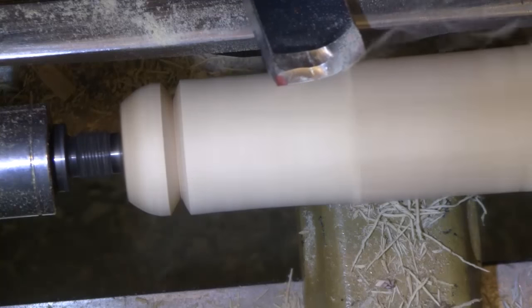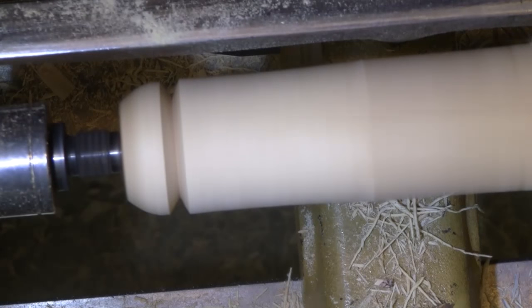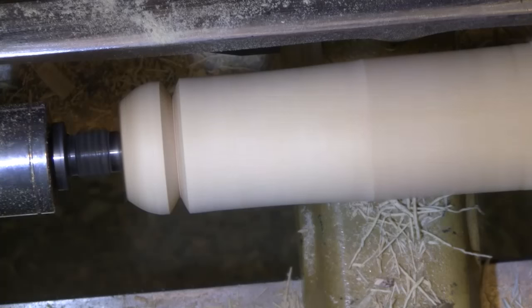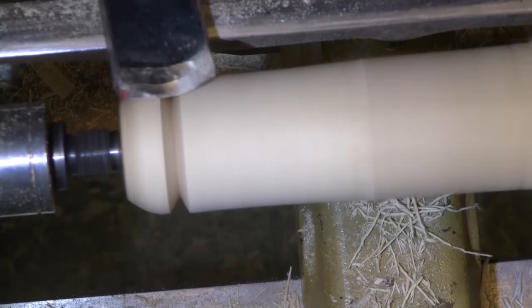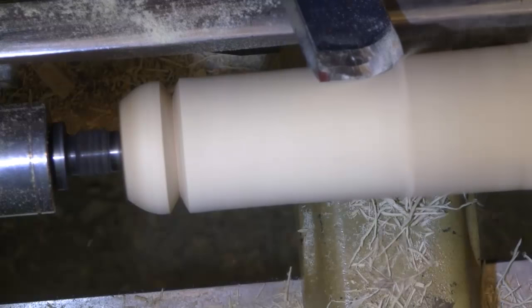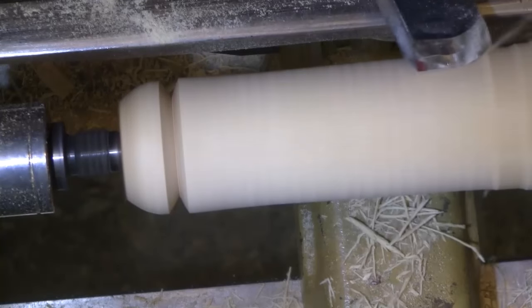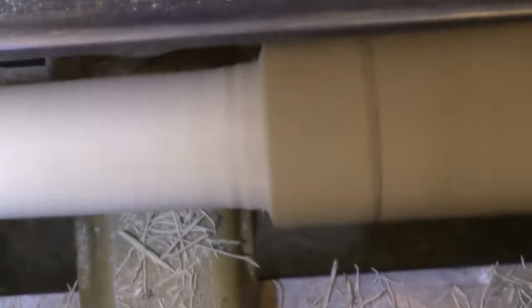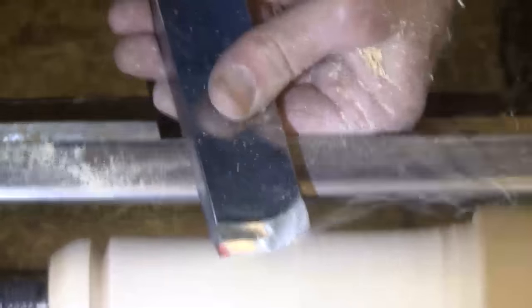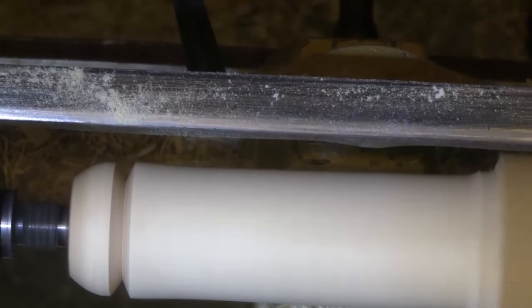You don't want to proceed faster than the wood wants to be cut. You can turn at very high speeds on the spindle — it's captured between centers, very strong. And if you get a catch, it's kind of scary but it's really safe; it's startling, but the wood's not likely to come off or throw a big piece at your face shield like a bad bowl catch where the bowl comes off the lathe. If you go too fast, you're going to start getting ripples, because you're coming off the bevel — as you get in a hurry, you're lifting the tool too much instead of riding the bevel. If you're getting ripples, slow down a little bit, drop your hand, put consistent pressure on it, and you should get a pretty good surface.